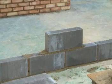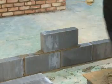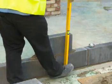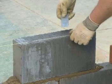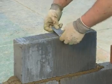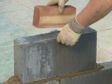To place a tingle plate, a block should be laid in the centre of the wall, making sure it's to gauge, level and plumb. Next, place the tingle plate on top of the laid block in the centre and insert the line through the plate. The line should just touch the block.